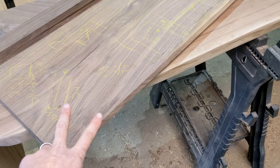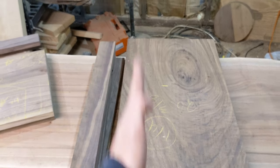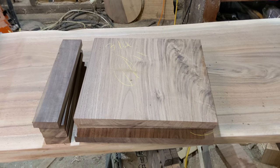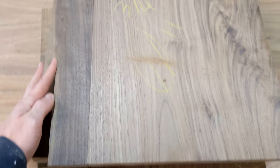This looks a little chaotic but I like to draw everything out. I use a yellow crayon which shows up really well on the walnut. This console is going to have shelving in it — here are my vertical braces and over here are my horizontal braces. I got all those milled, flat, and square, and these pieces here will combine into one because they weren't quite wide enough.